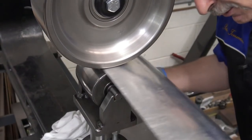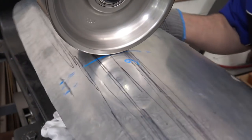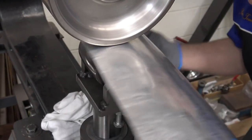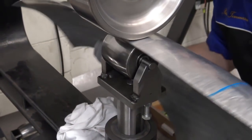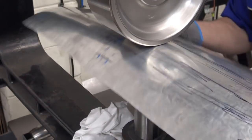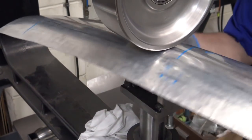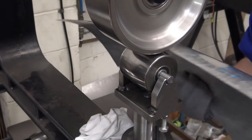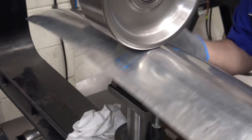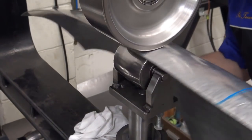Now notice that I also got a different wheel there, because that's not that round. Well, it is round, but I can use this wheel. It's just common sense. You don't wanna put the wrong wheel. The top of anvil changes all the time. You just don't use the same anvil, not on something like this anyway. And I've got no pressure on this. Look. That's the good part about full radius wheels. You don't have to put a mile of pressure.